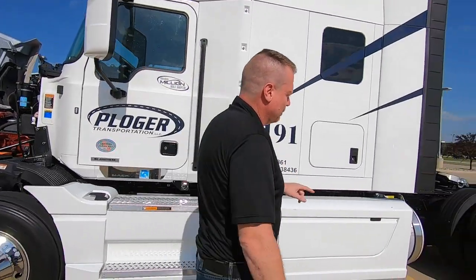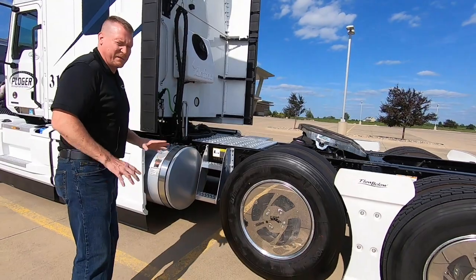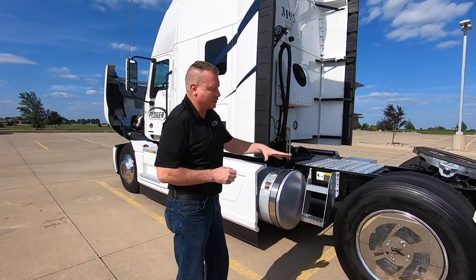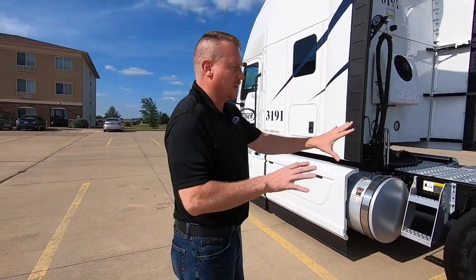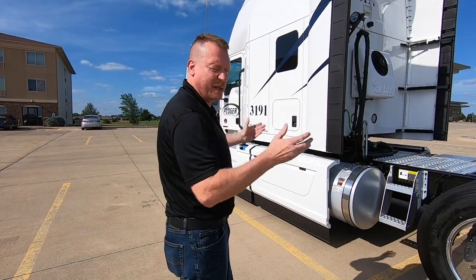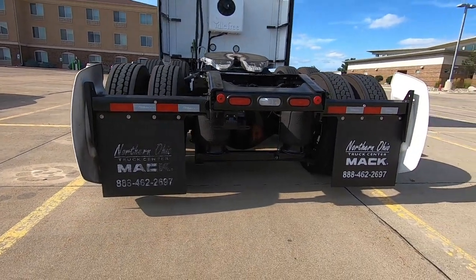Back here we get to the adaptive loading — this is the lift axle portion. It comes up off the ground when you're lightly loaded. Everything is automated; there's no driver interaction with this. It senses weight. When you are heavy enough to set the axle down, this axle will always bias weight to the drive axle. And because we're a pusher configuration, this axle, when it biases weight, loads the front axle and the back axle — the end points. So we have better steering traction in the wet or in the snow, and better drive axle traction as well.